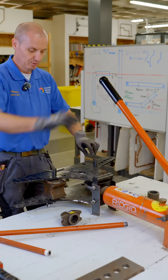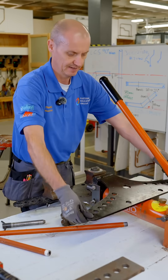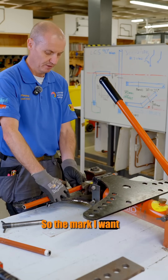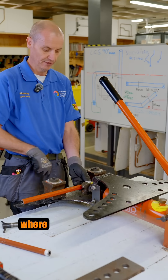I can push it down, the ram comes in, pushes through these two end parts. I can take them out in a moment just to show you. Move the wing back — I've got these two blocks, the pipe comes in, I put the wheel head on it, half inch, and then I can line my centre pipe up onto it. The mark I want is the one that I came back half an inch on. I put that right on the centre, and I've showed you with a sticker here where the nib is on that wheel.